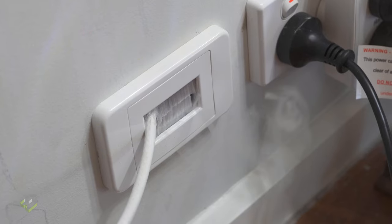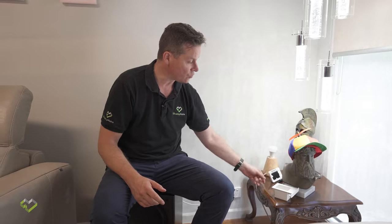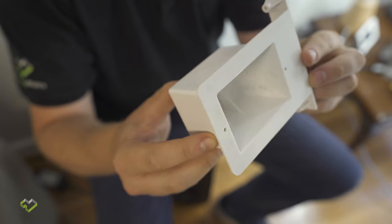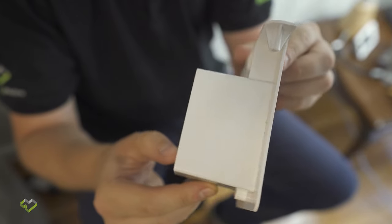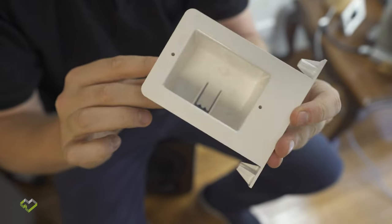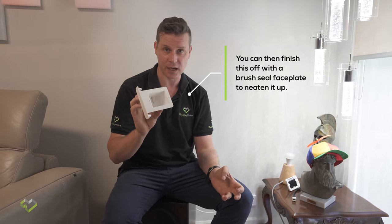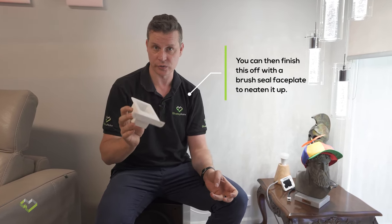So they're not ideal. What the solution is, and there's a few ways that this can be done, if you're going from top to bottom, is using a backing box and then connecting this to conduit to another backing box, and then sealing up all of the penetrations through this backing box and then obviously sealing the face of this to the plaster behind your cabinetry or TV.